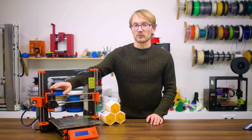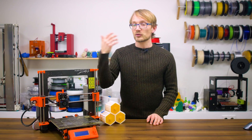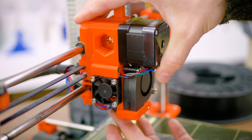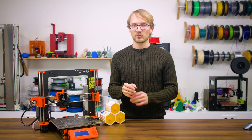If you grab the moving parts of your 3D printer — typically the hotend and the print bed — and try to rock them back and forth, you might feel a bit of slack. While ideally the bearings should have zero play, a small amount of slack is usually acceptable.